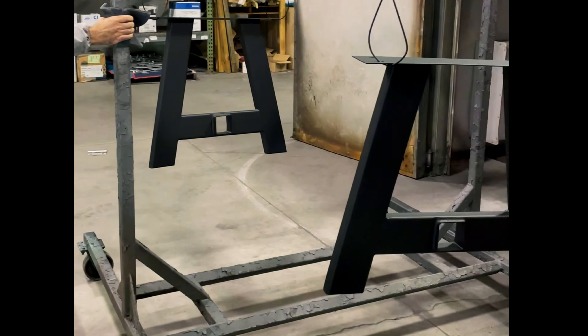My neighbor came over again and helped me flip the slab and lift the base up onto the table. If I do many more of these, I'm going to need a gantry crane in the shop. I used Loctite on the bolts and tightened the center all the way down, but the outer bolts were just snug to allow for the expansion and contraction I mentioned earlier. Fully assembled, this table weighs at least 600 to 800 pounds, and we were not looking forward to getting it off the workbench — until I was helpfully reminded that I have a tractor that could do that for us.